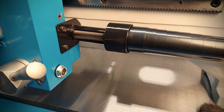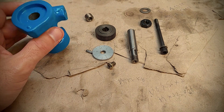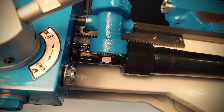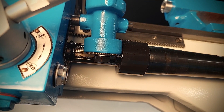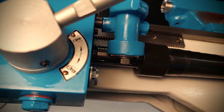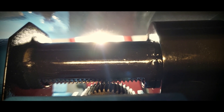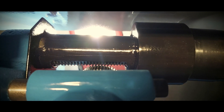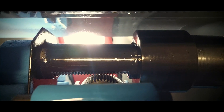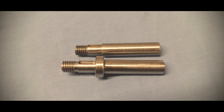Finally, the last piece of the puzzle — let's look at the thread dial indicator. This lathe came with this thread dial from the factory, but I can't understand how they ship something like this. Allow me to show you the problem. Did you see what happened? As the lead screw rotates, eventually the keyway will align with the end of the dial gear, and in that moment that gear disengages from the lead screw. Problem? A big clunk when it tries to engage again. And I was lucky not to break the lead screw or the dial. Luckily now I have a lathe, so I can make a new shaft with a spacer to fix this, basically keeping the dial engaged at all times.